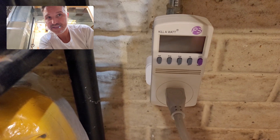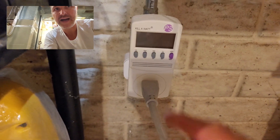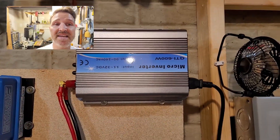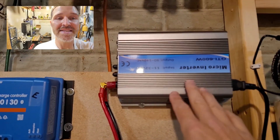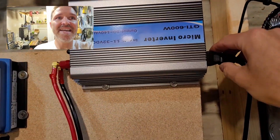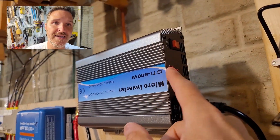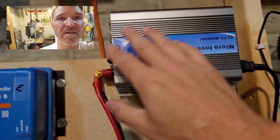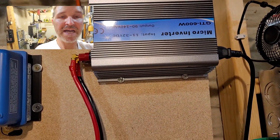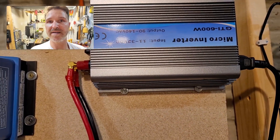I'm going to demonstrate exactly what happens when I turn on this plug. One of the safety features of this grid tie inverter is called islanding. What that means is if it does not sense any AC electricity coming from your house, it will not turn on and will show a red error light. That way it's not pushing electricity from my batteries through the grid tie inverter and possibly hurting a linesman working on a down line.